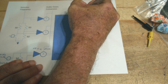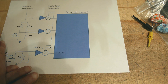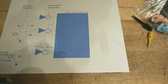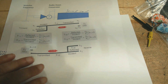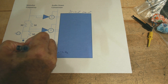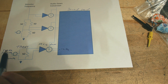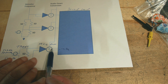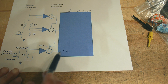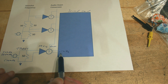This big blue box is basically a sound card, or you can think of it as an audio frequency oscilloscope — a frame grabber kind of thing. And it's triple channel — it can measure three channels. Remember we needed to measure three things: incident, reflected, and transmitted. Well, here's our three. This one is transmitted. We measure it, mix it down, send it into audio land, and all the frequencies become audio frequencies. That way our microprocessor can handle everything — it can't handle 900 megahertz, but it can handle audio frequencies.